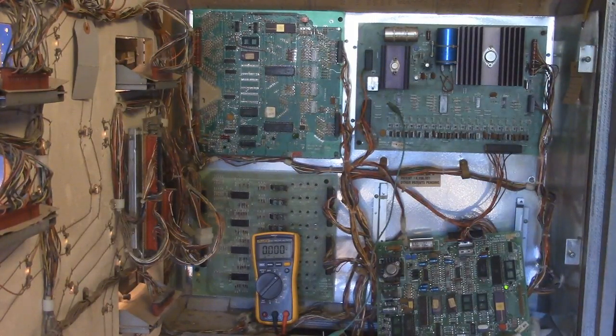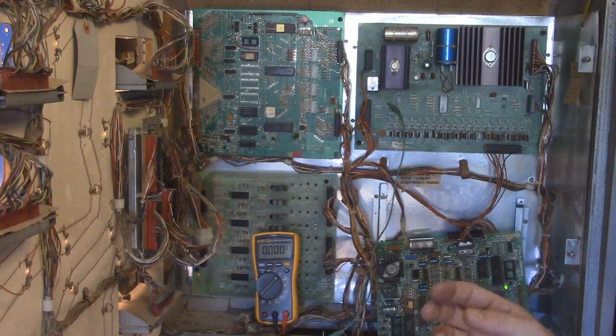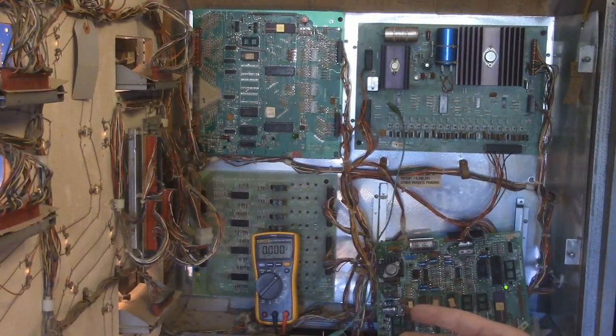Now, once again, we're dealing with 10% tolerance, so that's only 1.1. I mean, not percent. So if we have 11.9, we'll just be generous and say 12. That should only give us no more than 13.1. This is giving us 14 plus, so that's closer to 20%. I'm thinking that's because some power is not going somewhere, right? I'm thinking that's why we're not getting that voltage drop.